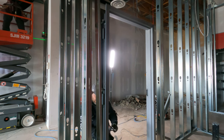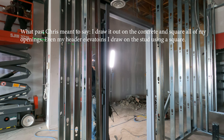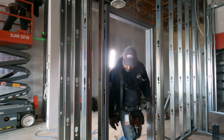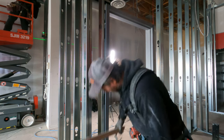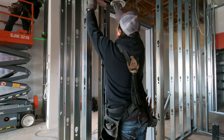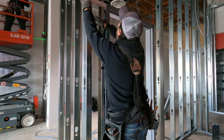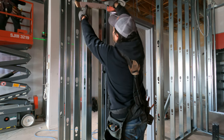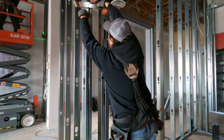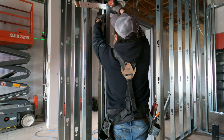It's already squared because the lines are squared — I always square my doorways. I'm screwing in the bottom stud on both sides. I'm not screwing in the top yet — just getting it set for drywall first. Get those clips screwed in before going to the top. I'm using a spacer at the bottom and a spacer at the top, and that's it. Your door will be level because your wall is level.